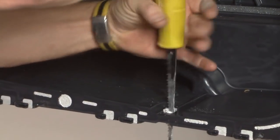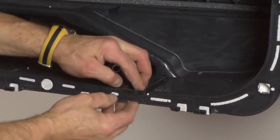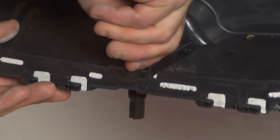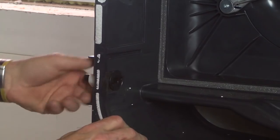Punch out the bottom hole for the drain. Seat the gasket in the cavity. Insert the drain connector and hand tighten the nut. Perform the same operations for the left side drain hole.